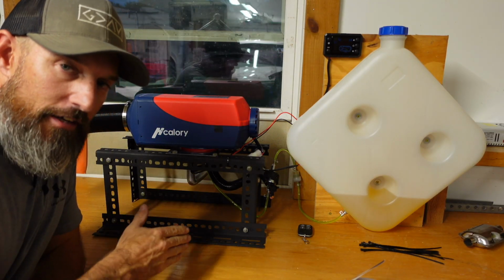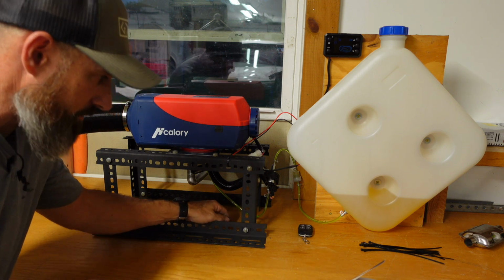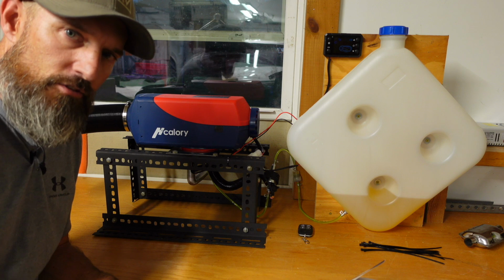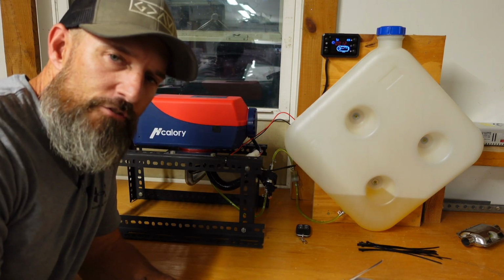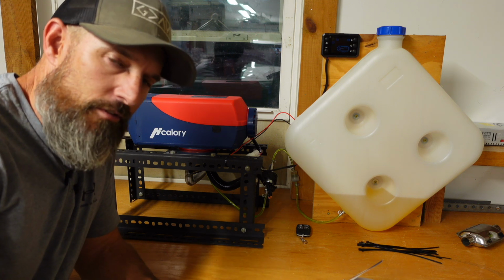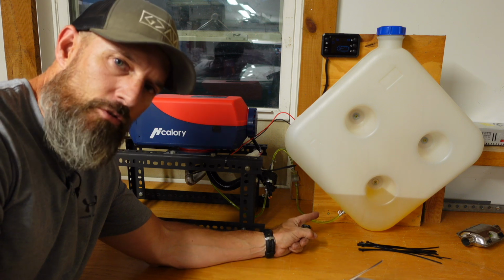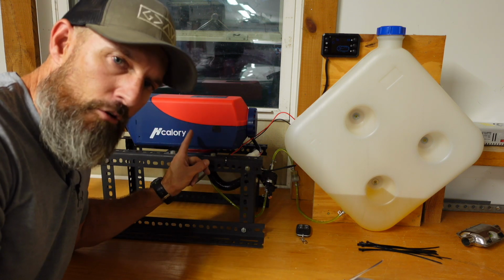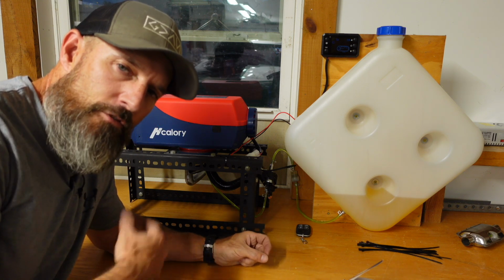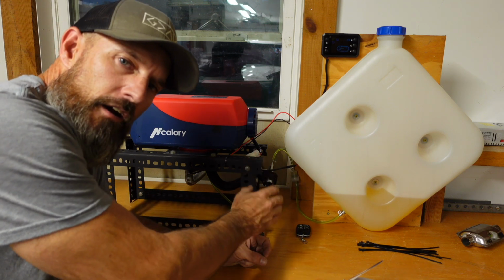I think it's shutting down right now because it didn't light. And that's probably because of all that air in the system. So I'll let this shut down and we'll start it up one more time, see if it takes off the second time. Now some of this video I may be fast forwarding for you because you're not going to want to sit there and just listen to that thing click and click. But it does take some time to get that fuel to run through that line and for the glow plug to heat up. And like I said, it may take one or two times the first time you initially hook all this up to get all that air out of the line.